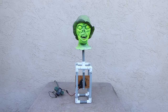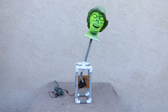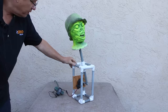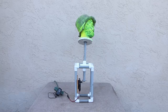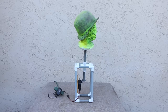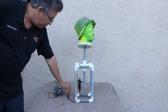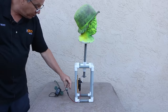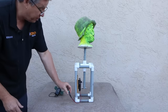With this build we've taken it up a notch — we've added another bracket to get the motion we want, using that three-quarter-inch cross we talked about earlier, and added some washers to the sides to provide clearance. You'll also notice it's connected with a lock nut — make sure to at least use a nylon lock nut or double-nut your connections so they don't work themselves loose over the course of the evening. Those little barrel connectors for rewiring wall warts are really handy to keep on hand.